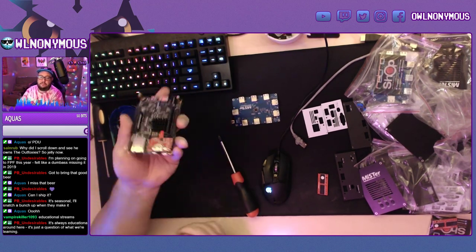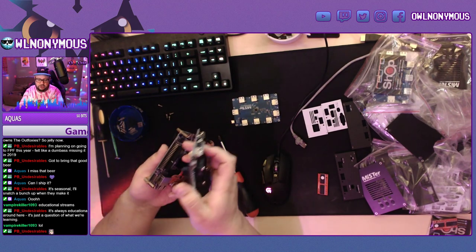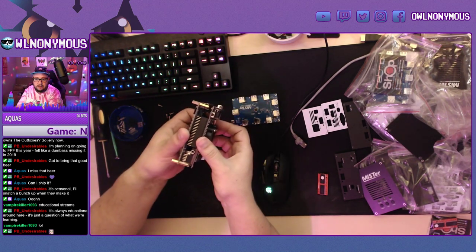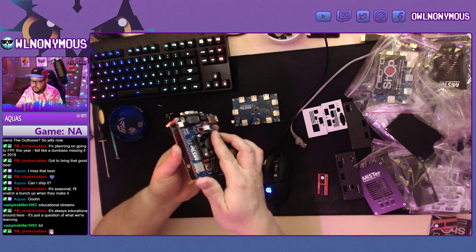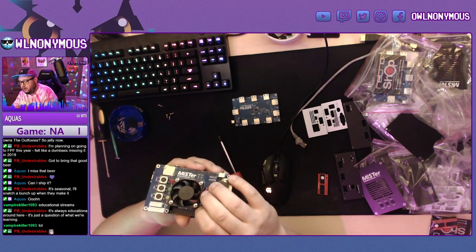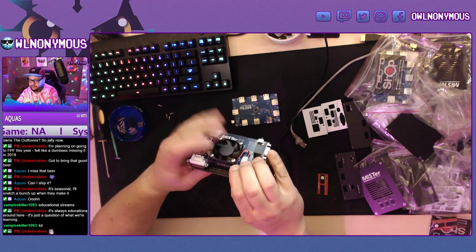Alright, so with the Ethernet port facing towards you and the buttons facing towards you, you push them together. This big black connector connects to this row of the GPIO pins. You're also plugging in the analog audio in over there. So I started these. Now I'm gonna make sure all my pins on this side are correct. And they are. So I like to push that side in and then push this other side in. Just like that. It's nice and snug on both sides.